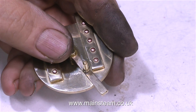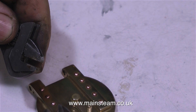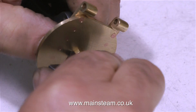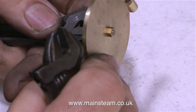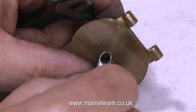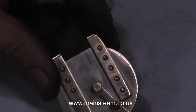It is not enough just to have a bolt through the door with washers — it needs a lock nut on the other side to hold it in place; without this the bolt would eventually work loose and fall out. The procedure with two spanners is to tighten the bolt, feel the latch, and once the latch feels really good with no appreciable play, tighten the lock nut on the back of the door. Having a lock nut on the back means I'll be able to adjust the latch to take up any play that may develop over time.